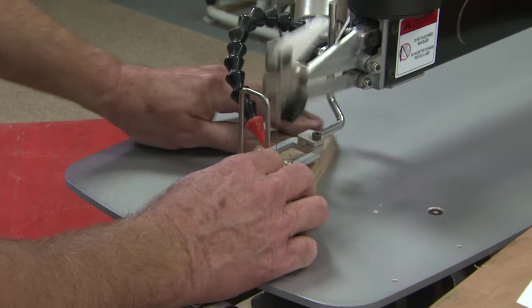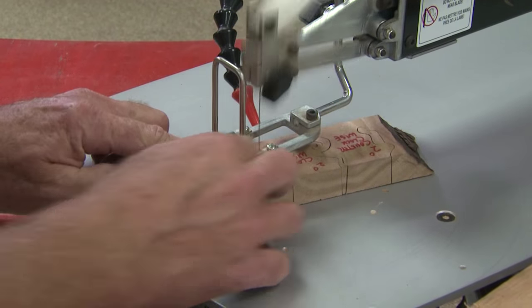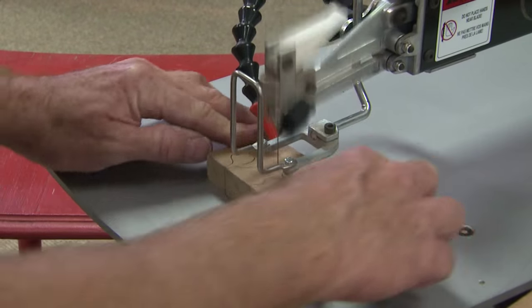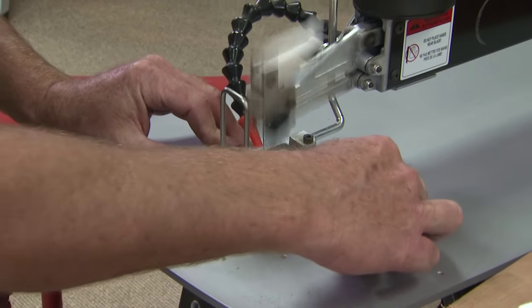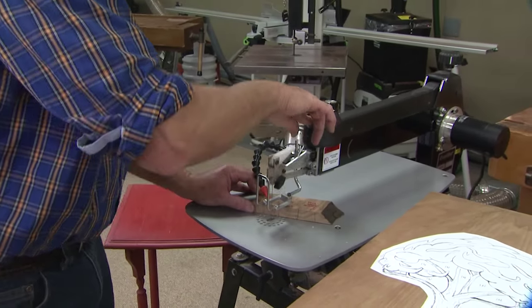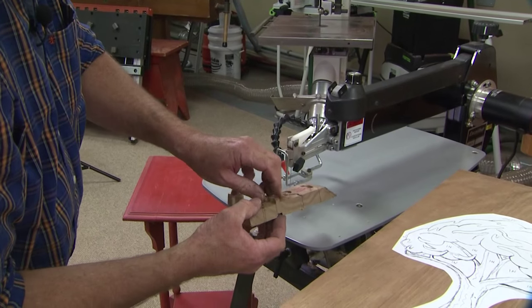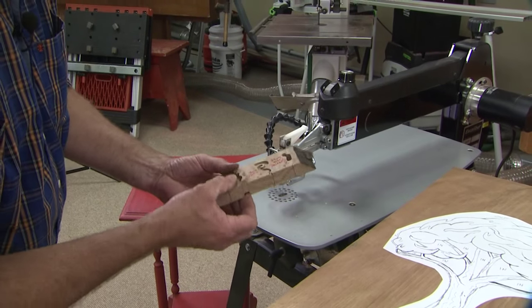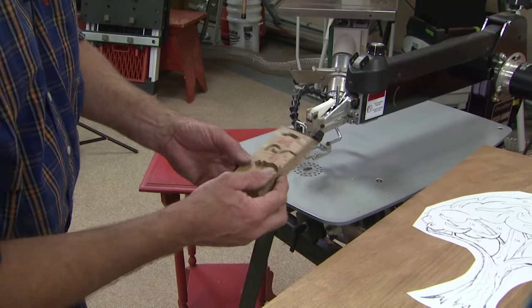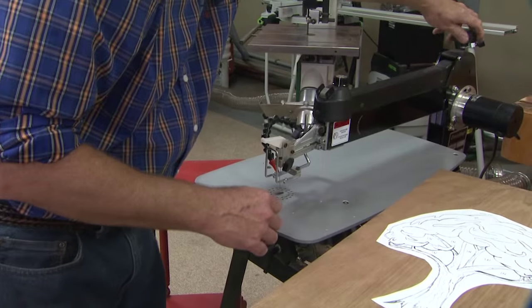I'm making a counterclockwise cut right now. This blade is absolutely magical. So what we're going to do is give the entire project its look. This pops out and locks securely like a cork in a bottle — you can see the cut is kind of V-shaped and it pinches it down. So what I'll do is release the tension back here, release the knob and the tension knob, then release the blade and bring the arm up on this scroll saw. The blade is slightly bent but there's a lot of life left in it.